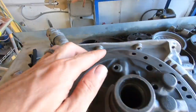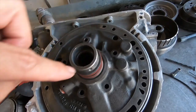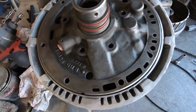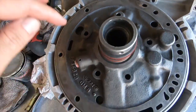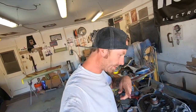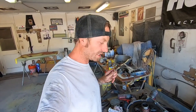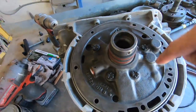The case is going to hold the pump so the two halves are centered. I can start the bolts and snug them down, then torque them. This is the way to do it — start the bolts, make sure everything's lined up, torque them down, and the pump is assembled. Using the case as a jig is kind of where it's at instead of trying to align it freehand and hoping it's right. Bolts are in and snugged down.